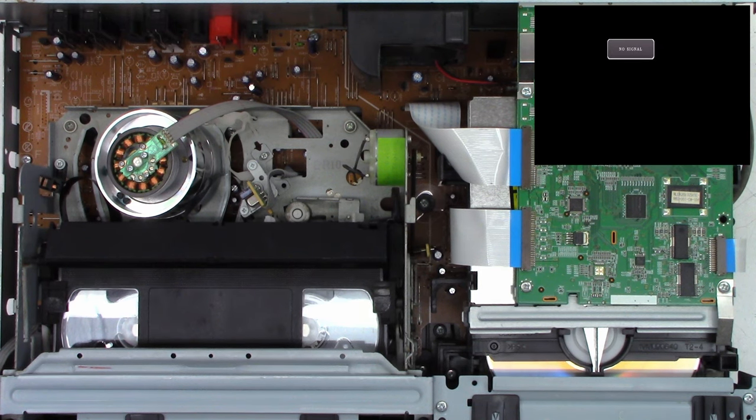Okay, so here's the DVD board capacitor view, and I've noticed that some of these units, especially the later ones, have better quality capacitors. They don't seem to fail as much as the earlier versions did. Let's just go ahead and test them all. That's a 330, and I get 1.1 ohms, not too terribly bad for a surface mount. A 47 at 2.4, I'm willing to live with that. Another 47 at 6.3, 2.3 ohms, fine. A 330, 0.3 ohms, I'm okay with that.